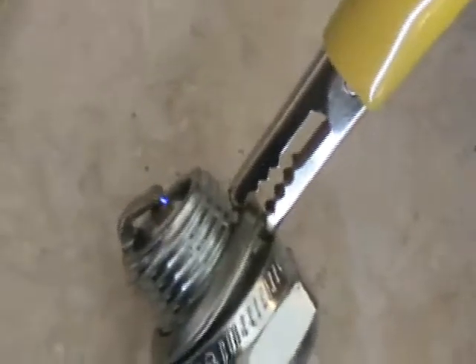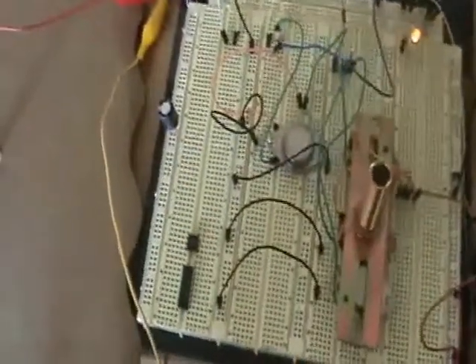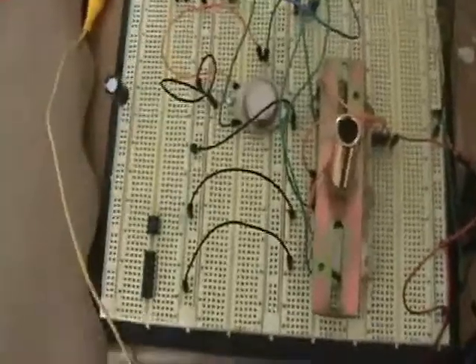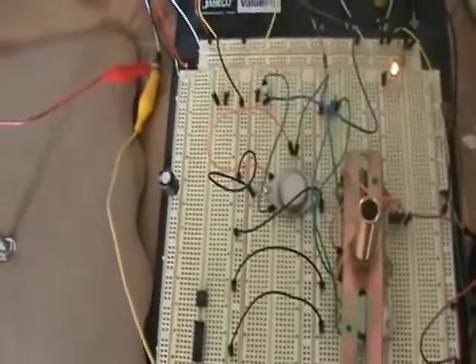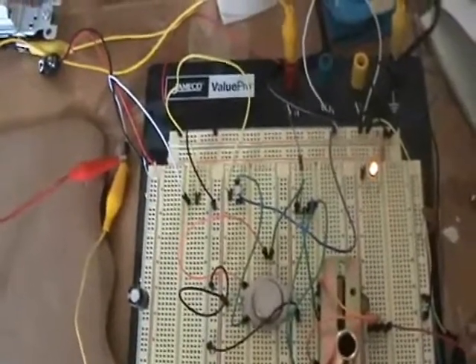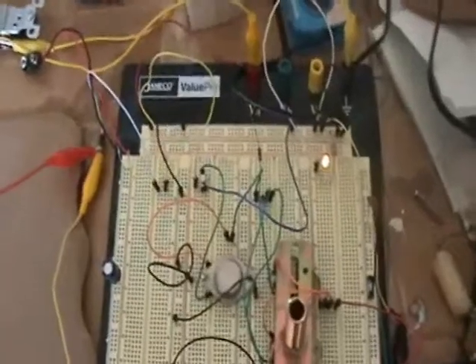You can adjust the gap by pushing it with pliers. One thing I played around with was trying to use a 555 timer with optical isolation. The issue with putting a 555 timer directly on this thing is there's so much oscillation and inductive behavior happening with high voltages that any TTL chip would just absolutely freak out or even get ruined. I was thinking I could use optical isolation to better control the frequency coming into the 2N2222 transistor on the base, but I completely failed.